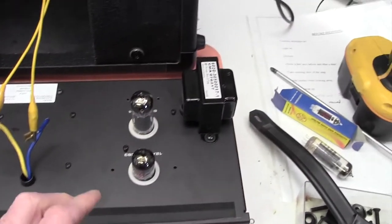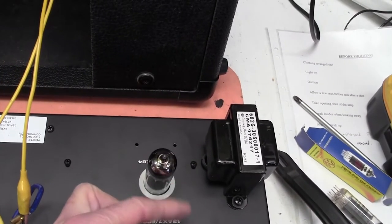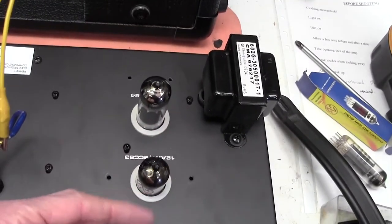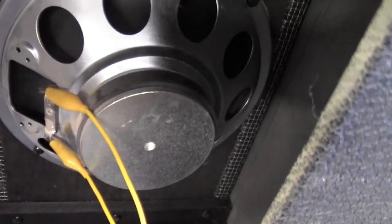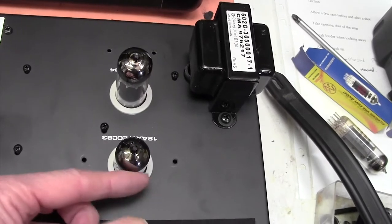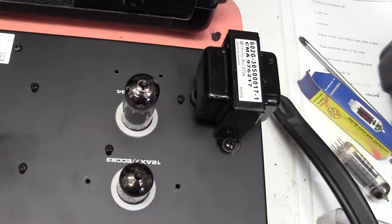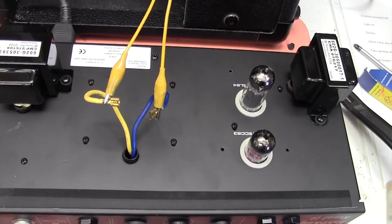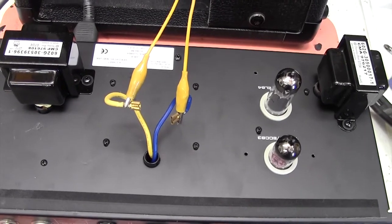Here we are — I've got a new JJ EL84 in there and it's a lot quieter. I can tap that and what you're hearing now is coming straight from the valve to the camera. Just checking this preamp valve as well — there's none of that metallic ringing coming from the loudspeaker now. So I'm guessing that if I pop this chassis back in, we will have cured this problem. It only takes about 10 minutes to put the chassis back in, and we can see if that was an acoustic resonance problem in the EL84 valve.